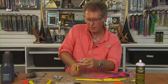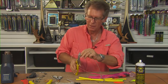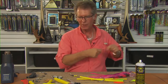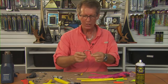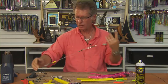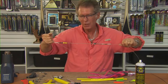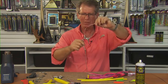This time we actually start crimping at the thimble end. If we start at the other end we'll tighten up the nylon inside and it will affect the crimp and weaken it. So we do start at the thimble end when doing nylon. Both ends, turn it over, crimp again. Now it's always a good idea to check your work — your crimps might be wearing out, your crimping pliers, or you might have chosen the wrong crimp. All you do is put the hook through the loop — good bit of exercise too. Take a couple of wraps, you should really wear gloves for this, and give it a really tight pull. Get a couple of mates to do it too, as that will show you that you've crimped everything up correctly.